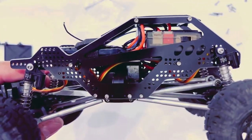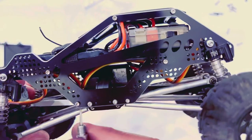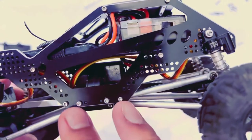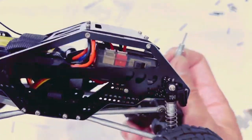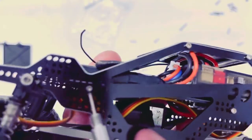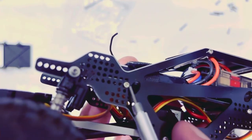We're going to go over the holes one more time. To summarize: the two outer holes get the longer screws, and the middle ones get the shorter screws. I reused the same hardware that came with the C10 original frame — you can do that too and just have leftover screws as a backup. The next set of holes that hold the deck in place: of these eight holes, it's going to be the bottom right on the left side panel. For the front of the deck, find this oval and it's going to be the middle one of the first column.